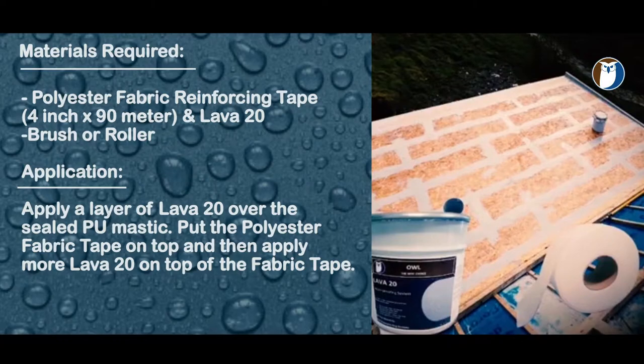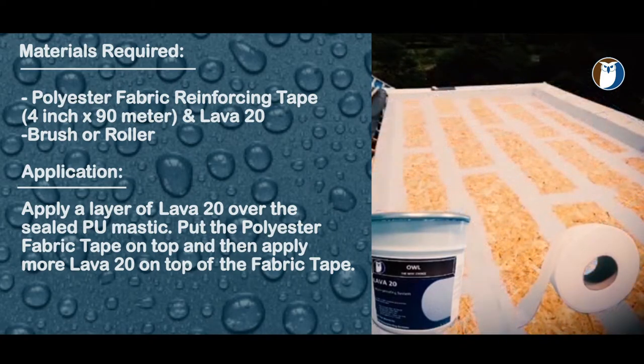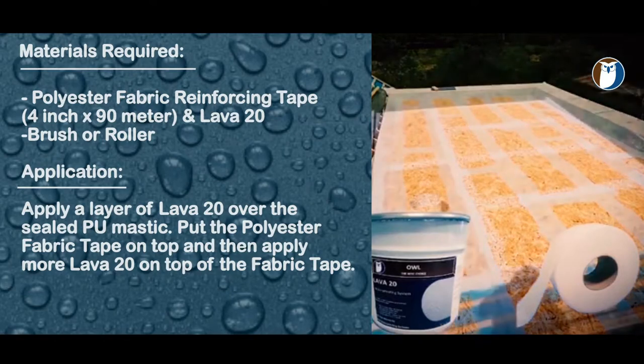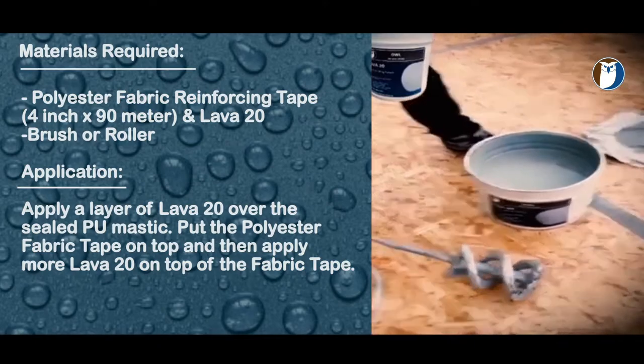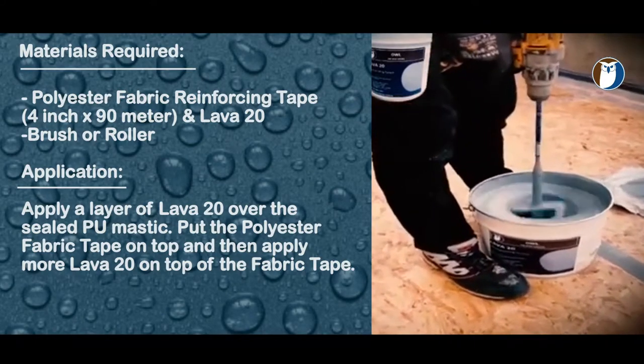Here are some examples of roofs that have reinforced the joints with the Lava 20 and fabric tape. Again, Lava 20 liquid followed by polyester reinforcing fabric tape, followed by more Lava 20. This creates a strong, chemically bonded joint reinforcement.